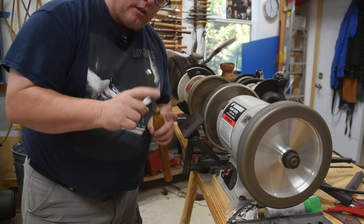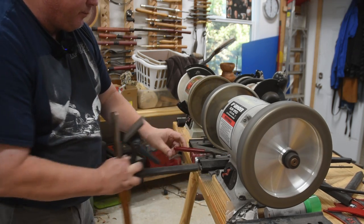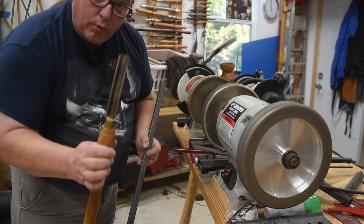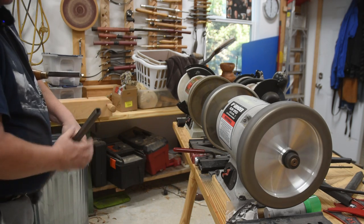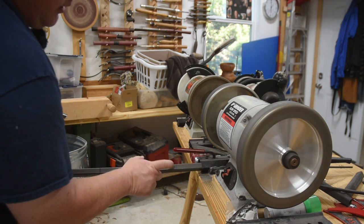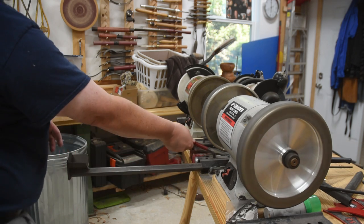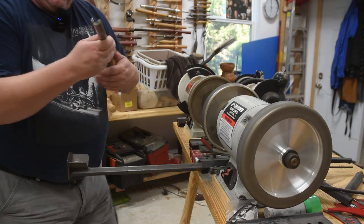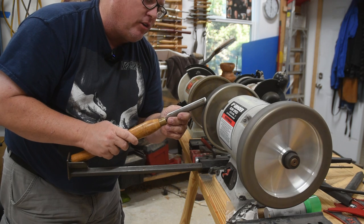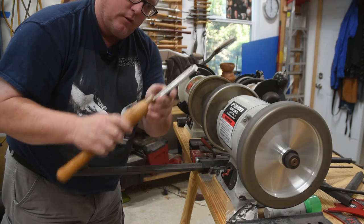If you don't want to use the platform for the spindle roughing gouge, you can do it with the bar. Remember me talking about putting those lines on the bar? I have a line for this particular roughing gouge. I slide it in, place my finger on the roughing gouge line, come forward, and tighten it up. Because it's a flat grind, I can basically just drop this in at the wheel, touch it down, and grind it across — it'll make a perfect shape, ready to rock and roll.